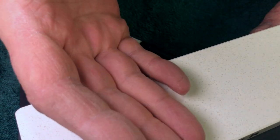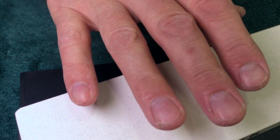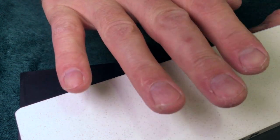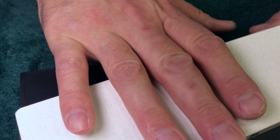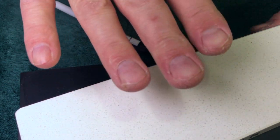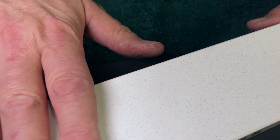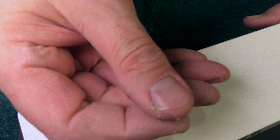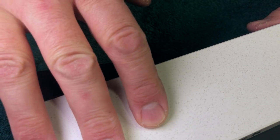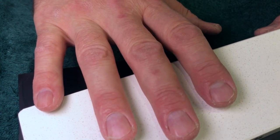So what I did was, and I don't recommend this, because it's problematic to do what I'm about to talk about, but I used silicon carbide powder. I used 80 grit on a stainless plate that I know to be true, and I beat the crap out of this stone. I just stripped off so much stuff. Now, I don't recommend that because those particles can break down and embed into the stone, and the only reason I was okay with it was I had written the stone off and didn't really care.